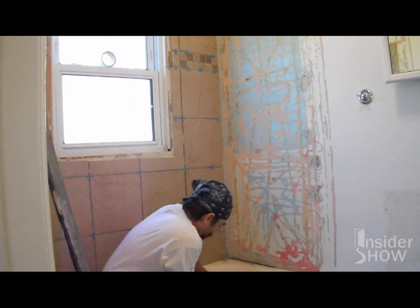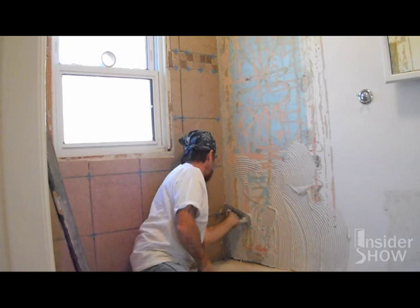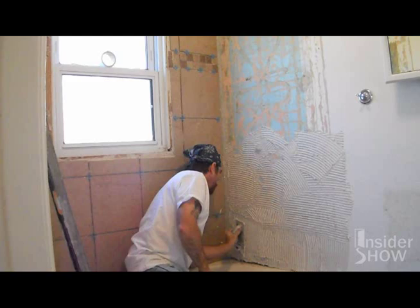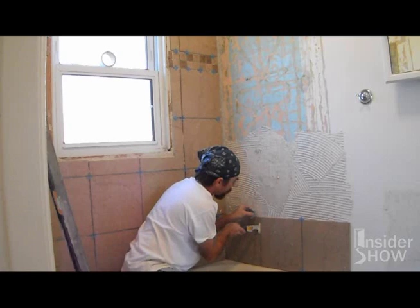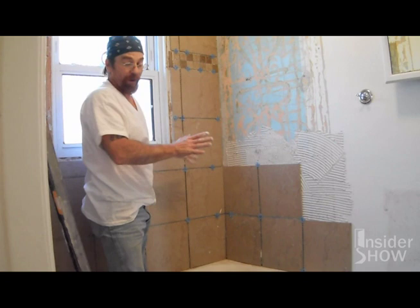We're ready to put the mortar on this wall. We've got the nylon mesh reinforcing tape in the corner that we put up first. I wouldn't put too much adhesive on ahead of myself because then the mortar will set up. It's just a matter of lining them up and pressing them in. It's handy to have a little painter's spatula or a similar tool for fine adjustments. Make sure you get good contact — I give them a little slap. Then you continue on up the wall. They do want to slide — gravity, it's not just a good idea, it's the law.